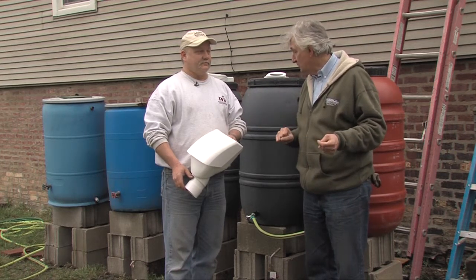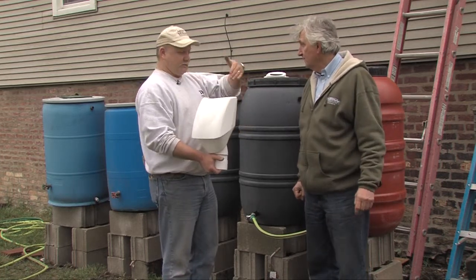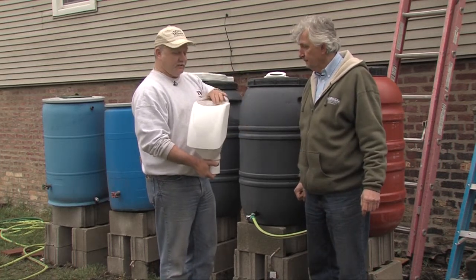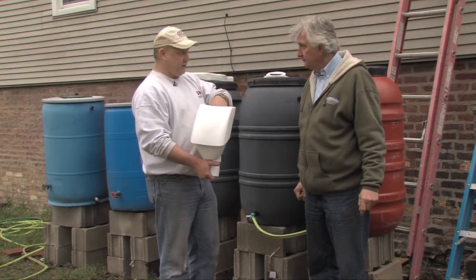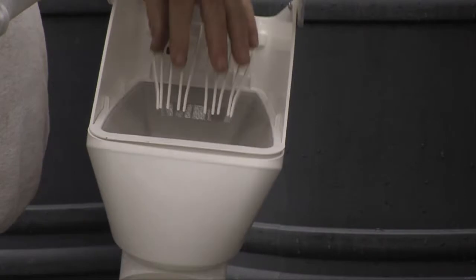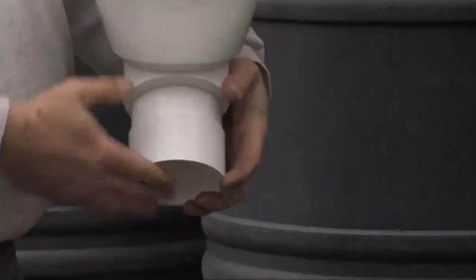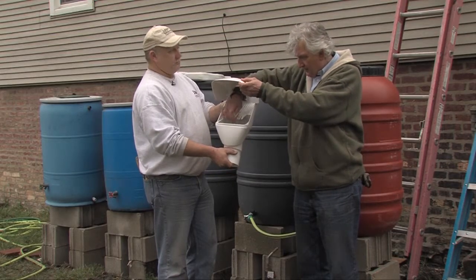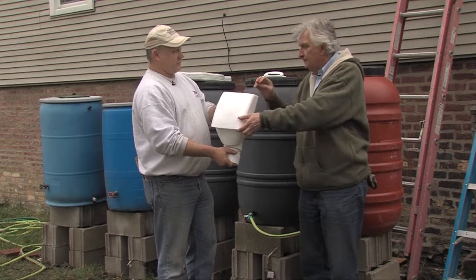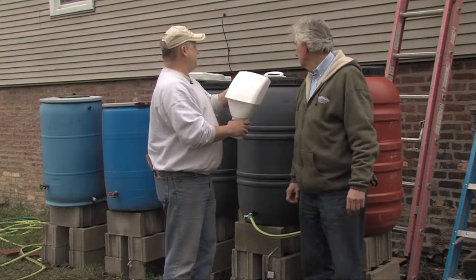You've got a diverter here and that comes off the downspout. The water comes down the downspout, it hits this and then inside there are actual fingers. And you can see inside a filter. So all the debris will come out, filtering the water, so you only have clean water going down. The debris hits these fingers and then bounces off, and then the screen filters even more. And then the water comes through here, so now you have nice clean water coming out the bottom.